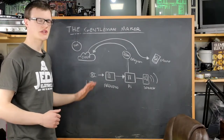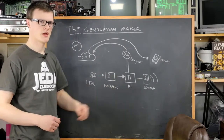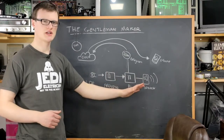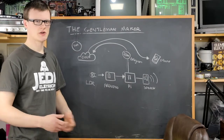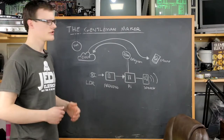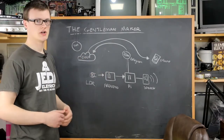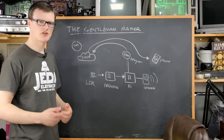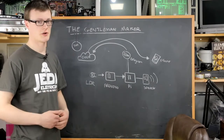When sunlight hits the LDR, it will send a signal to the Arduino, which in turn sends a signal to the Raspberry Pi. When the Pi detects this message, it will then send an alarm sound to the speaker so that people nearby know it's time to make the most of the sun. However, some users may be too far away to hear this sound, so the Pi also sends a Telegram message to anyone connected to the sunbot using the cloud — but with the internet, not the clouds in the sky. After 15 minutes, the Raspberry Pi will then send another Telegram message to all connected users warning them to go back inside.